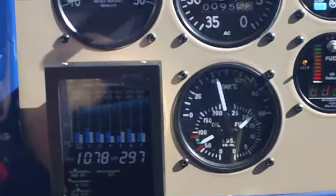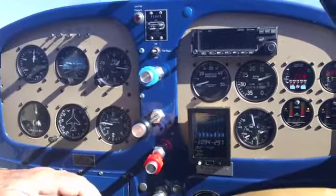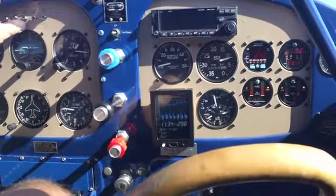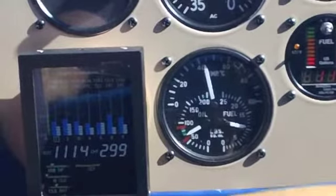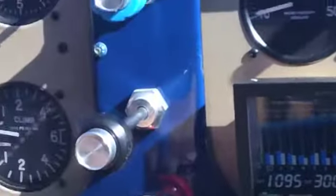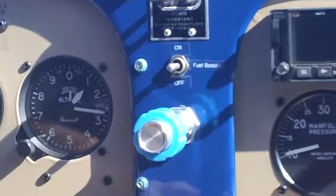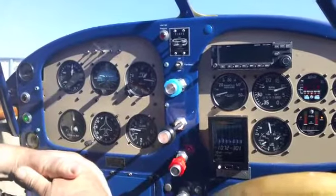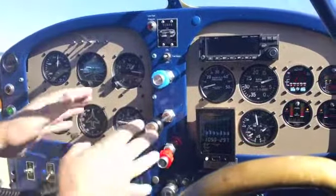Let's cut it off again and let it go down a little bit more. There she goes. Watch for the RPM to drop a little bit more. Now, fuel pressure's down to 12, 14 pounds — there it goes — right back again. You'll notice that all of this was accomplished without the boost pump on. This is the engine-driven pump only. I'm quite satisfied with the draw and the airplane's ability to pick itself up should a tank run dry. And of course, in flight we have the help of the windmilling propeller. On the ground we don't — it has to pick itself up.